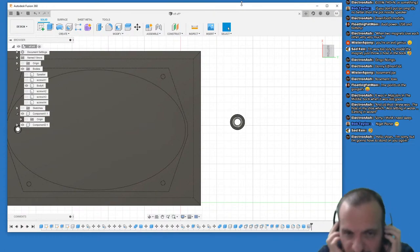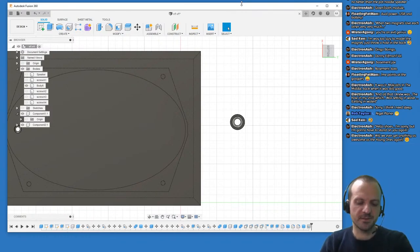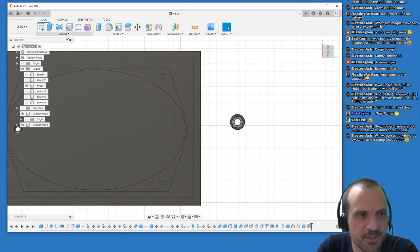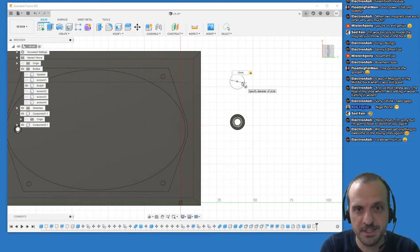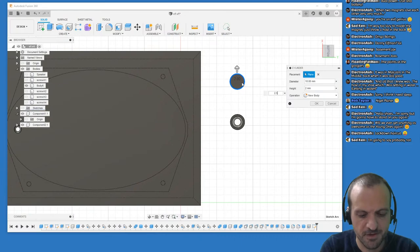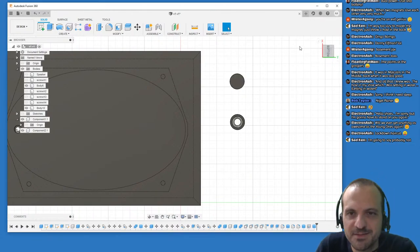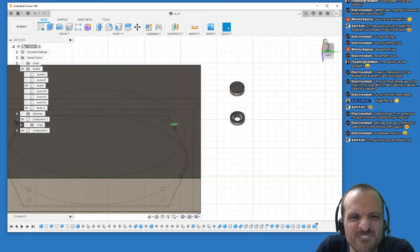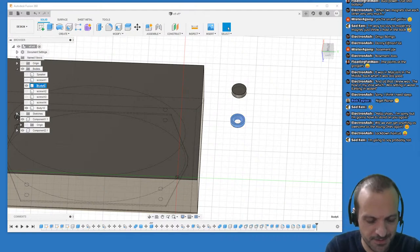The reason is, did we need to create this? I'm wondering if we needed to create this, because ultimately we're not creating a magnet hole that has to be precisely to a magnet. We just need to create a 10 millimeters by 2.5. Let's give it a tolerance. Let's give it 3 millimeters. That's good enough. That's basically what we could have just done. We didn't really need to model the magnet. It doesn't feel like we need to model it because we're just making the absence of it.